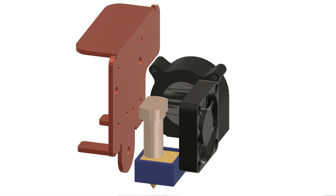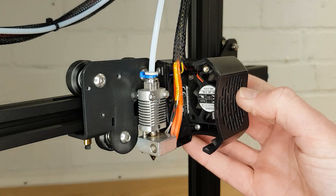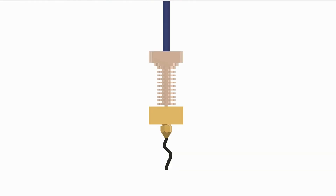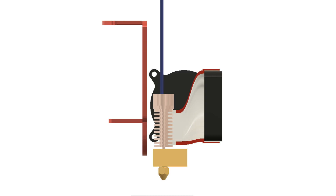After I was happy with that I set about designing a hotend cooling fan duct. A lot of hotend assemblies don't have a duct directing air directly at the hotend, but the main reason I'm adding one is that the fan is no longer directly in line with the hotend. As this is an all-metal hotend it's critical that we keep the throat of the hotend below the filament transition temperature — if we don't, filament will start to melt before it reaches the nozzle and we'll get a clog. I've therefore made a duct that directs all air from the fan through the cooling fins and avoids blowing any air towards the heat block, which would make it harder for the heat block and nozzle to reach the correct temperature.